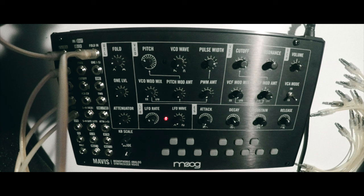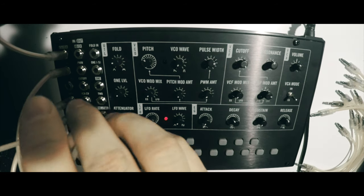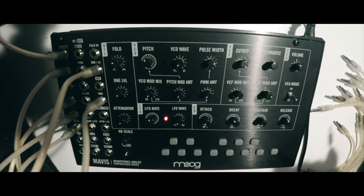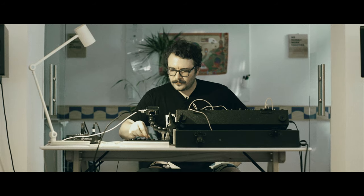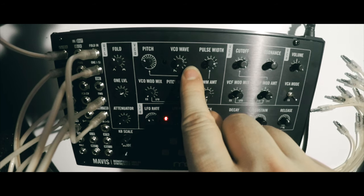The wave folder can't be voltage controlled, but one interesting feature is it's DC coupled. So if we feed modulation signals into it, we're able to modulate the biasing of the folder. I'm going to patch the VCO output into the two input on the mixer, the LFO output into the one input, and then the one-plus-two output to the fold input. Adding the LFO into the folder produces wave shaping that's somewhat similar to pulse width modulation, but accomplished via the sawtooth VCO instead of the pulse wave.